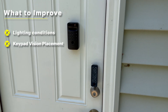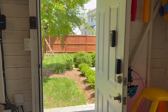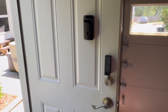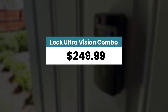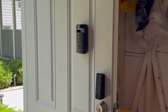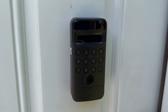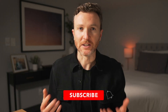The final thing is where you place the Keypad Vision. The placement location can be awkward — it must be at a certain height for facial recognition to work and several inches away from the door frame. Because of my height and the grooves in our door, I had to place it up high and in the middle of our door, resulting in a slightly awkward appearance. The Lock Ultra Vision Combo costs $250 in the US. While that's not cheap, it's right in line with other premium smart locks, and at that price it includes facial recognition and a Matter-enabled hub. Facial recognition on a smart lock is not new, but this is the first retrofit lock to do it. It's similar to moving from Touch ID to Face ID on an iPhone — both quick and secure, but facial recognition is just faster. Let me know what you think in the comments, give this video a like, and consider subscribing. Thanks for watching!